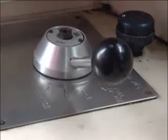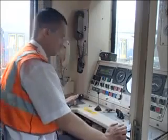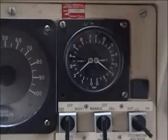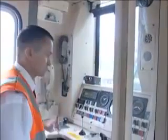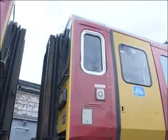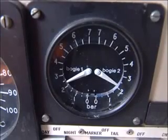Now place the brake controller in the step two position and observe the brake cylinder gauge reading. Open the intermediate gangway door, if there is one. Go into the opposite cab and check that you have the same step two reading on the brake cylinder gauge there. Now you can return to your cab, shut down and secure in the normal way. Then switch off headlights, markers and cab lights. If you are attaching in a station platform, there will be another driver present. He or she should assist in checking the alignment and condition of the couplers and check the brake cylinder gauge reading in the opposite cab.